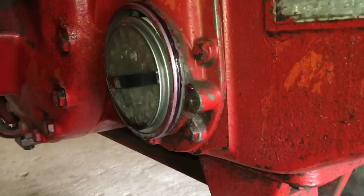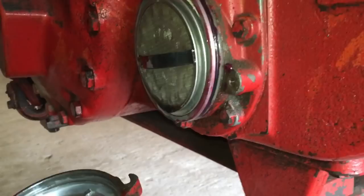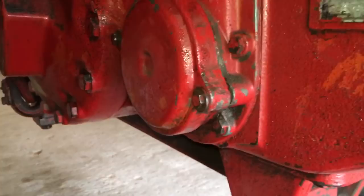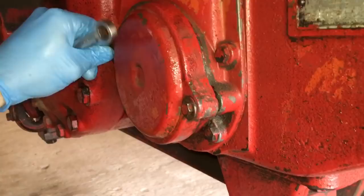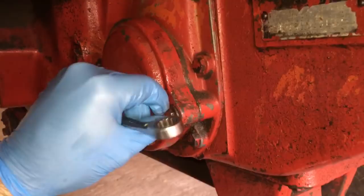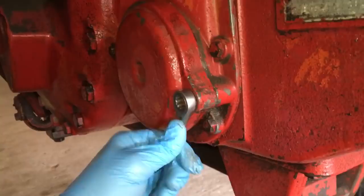The screen snaps into the new hydraulic filter and basically snaps into place. Then you can reinstall your cap. You can also put some grease in this cap. With that grease on there it makes it real easy. You can see the bolts are back in the housing — not factory, but it will work fine. The screen on the end has a little tab that makes it spring-loaded to help hold it into place. Once you have it started, it's just a case of evenly tightening down your bolts.